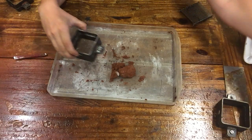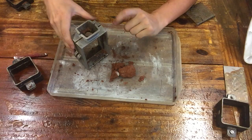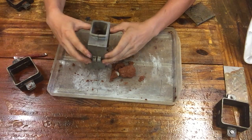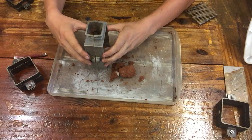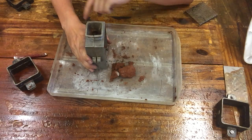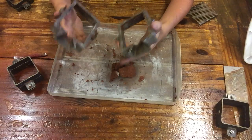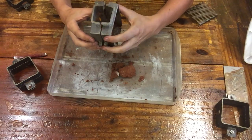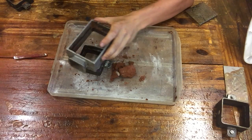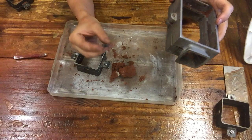The disadvantage with the aluminum frame is that once you're done, if you're planning on holding it vertically and you don't have the two components wired together, there's a lot of slop and the frame can just fall open from the mass cast in there. You have to actually hold it together and wire wrap it or use a clamp anyway. It's just a lot of extra parts requiring a lot of sand, and if your scale isn't bigger than this size box tube, why would you use that much sand to make an incredibly small part?